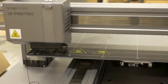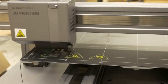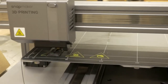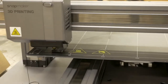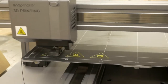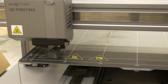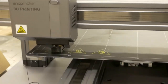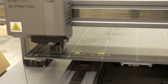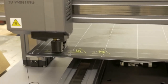Now it's time to print those in large quantities. 3D printing is a slow process — for a set of 3, it took about 3 hours from start to finish. The actual video you see right now is sped up about 200 times, condensing 3 hours into roughly 1 minute. Doing some math: for the 160 parts I need, at 3 hours per set, that's roughly 480 hours, or 20 days running the machine 24/7 non-stop. To be safe, I'm budgeting 40 days for printing, and I'll prioritize what gets printed first — for example, I immediately need the front and back holder, while the cap holder can wait for round 2.